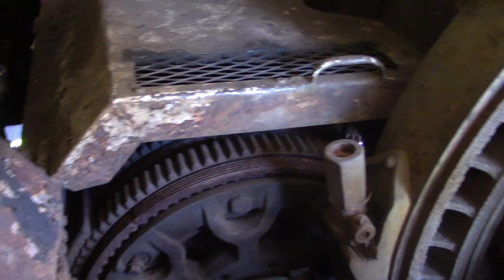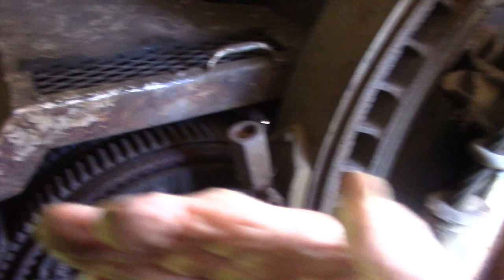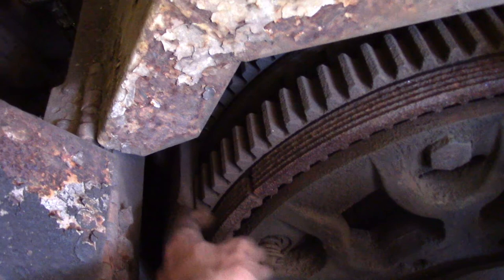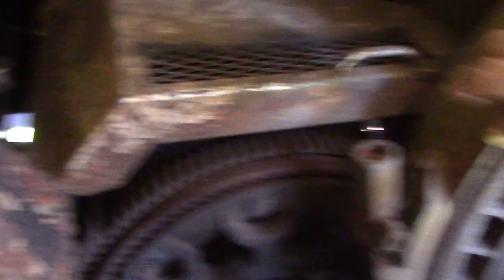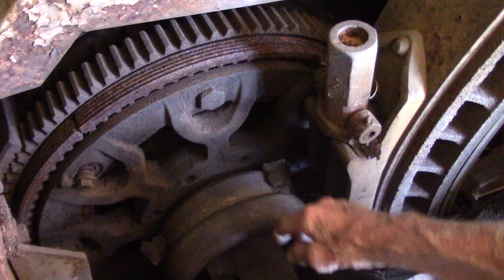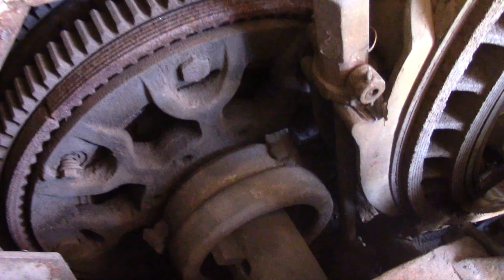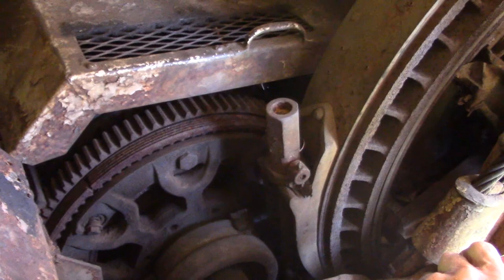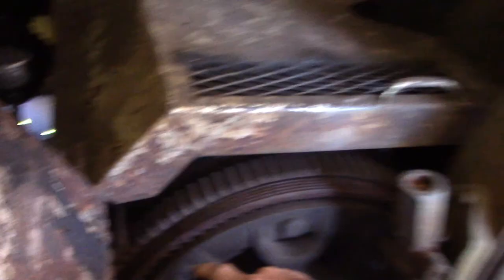You asked if the swing clutches are a cone clutch — no, these are a straight clutch. There's a flat lining on the side. They're stuck in there right now about halfway — that's your driver in there. That's the outside part. When you put them together, you loosen this collar first — here's your adjustment for your swing. There's a bolt here and a bolt there. When you turn it, you loosen it and that screws off, loosening your drum. You can probably turn it off by hand if the machine's been running — just loosen the bolts, put a little oil down the threads, and you can turn it off.